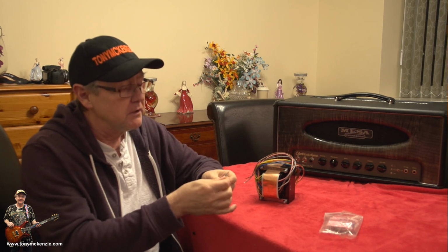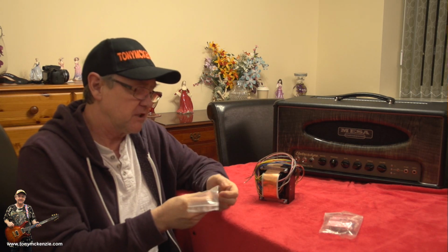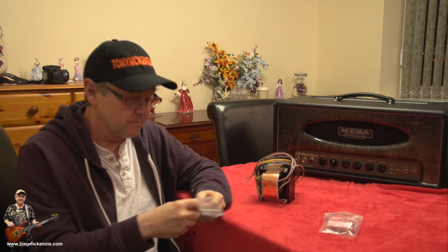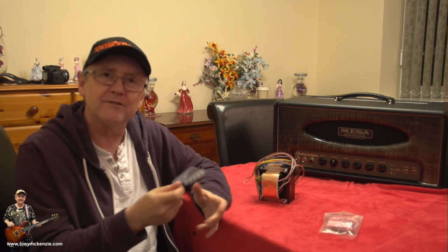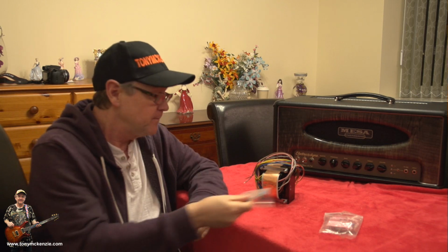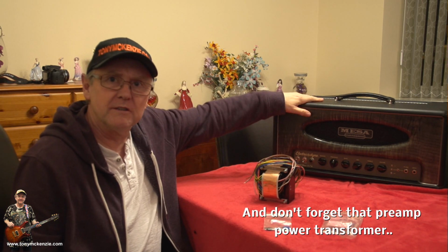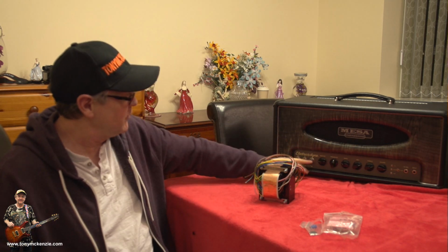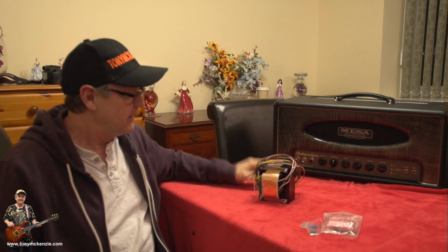And we need this other thing called a CL60, which is a bit like an explosive fuse type of thing, which will go pop if you get the wrong things going through it. This one's CL60, so that's for the UK. It's CL30 in the USA, by the way, by default. I'm not sure about the MOV, but when we pull one out, no doubt we'll have a look at that. So you need these, and obviously one of these or something very similar. These might vary depending on which amp you're going on. But apart from that, it's all take it apart, which is what we're about to do now. I'm going to pull the amp out of this nice case, and we'll get it on here and have a look at what we've got to do next. It's all going to be fun.